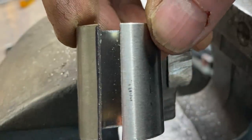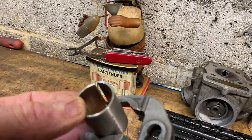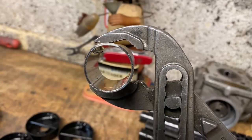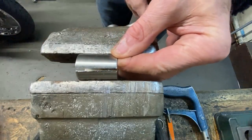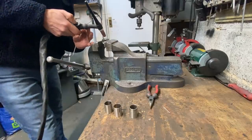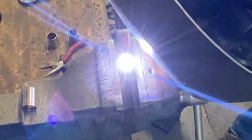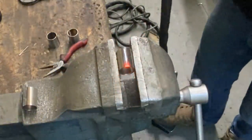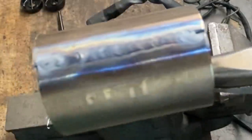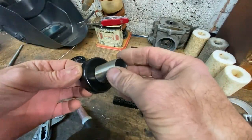I'm taking a bit of metal out the whole length so when I squeeze that down it'll reduce the diameter — that looks just perfect. I then grip the split tubes in my vice and gently squeeze the gap together for welding. There's the first one done, that'll do nicely. With the four tubes welded, the next thing I need to do is bore out the hole in the end cap so they're just a nice push fit, ready for welding.